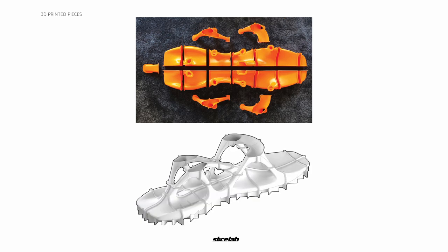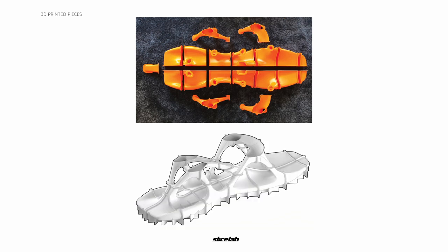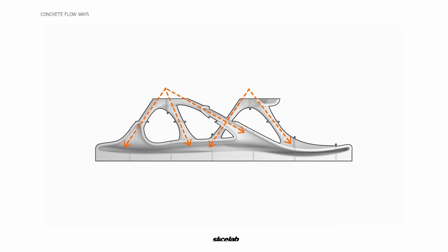We were finally ready to scale up our design. We made the table five feet long and calculated roughly 250 pounds of wet concrete. We also realized we needed 23 different pieces to be printed and oriented in certain ways to create the same structure — demonstrating that even with the least technology of 3D printing, anyone could make something like this. We decided to assemble these pieces as shown. The overall central spine was the most important to keep intact, so lining that up at the end was key. We could always sand or grind down pieces that were slightly shifted along that spine. We needed to funnel all 250 pounds of concrete through the 10 legs and three major openings.